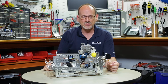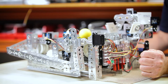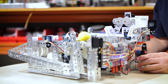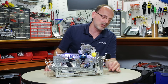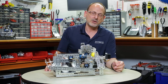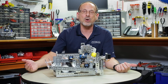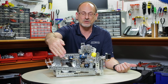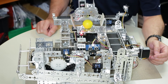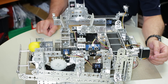I think we're ready to try to start it and see how it actually operates. I'm going to power it on — you can see some lights come on — and as soon as I get my green light from the Prism, I'll press my start button. My program right now is idling, waiting for my front ultrasonic to detect a body in front. If I move my hand in front, my process starts.